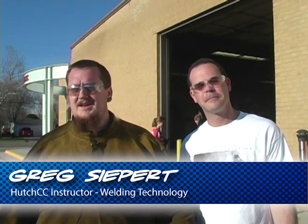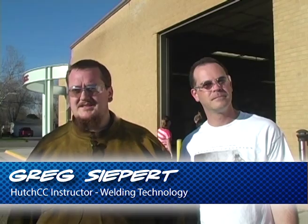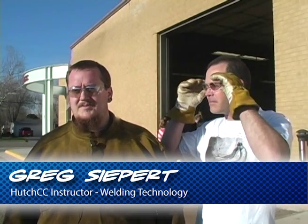What we're doing today is sculpture casting with cast iron. It's kind of an art club sponsored thing, for just a base knowledge of other stuff that's out there. For the process, we start with a scratch block, which is a sand mold with resin. It's like an epoxy that holds it together, and then they scratch and remove what they want cast into it.